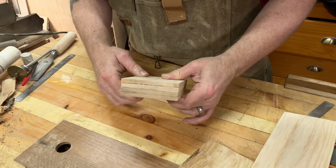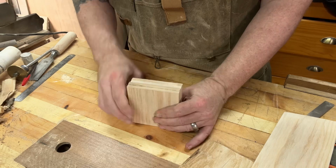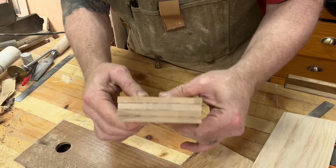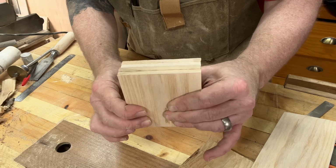Okay, so we've got all of the 4 pieces. I've not made them any shorter as yet, but we've got the edges that all need tidying up and getting to be exactly the same height because they're ever so slightly different. So what I want to do is pop them in the vise just like that and then hand plane them flat.